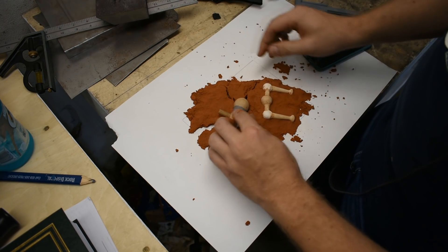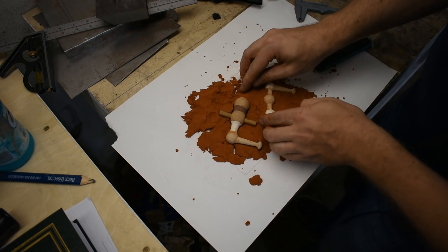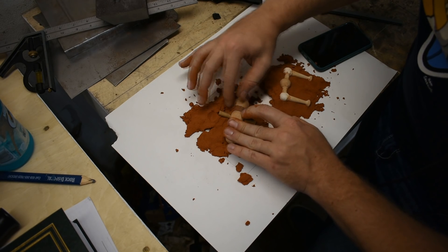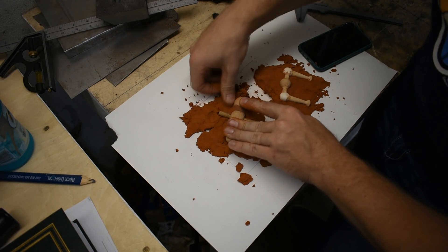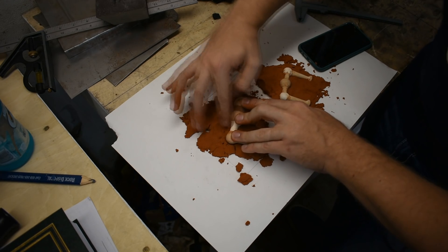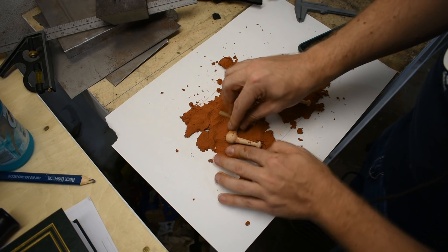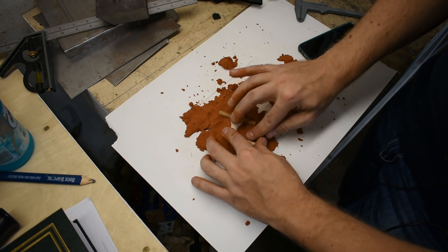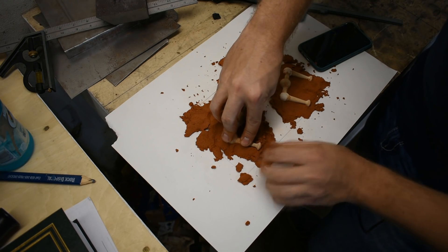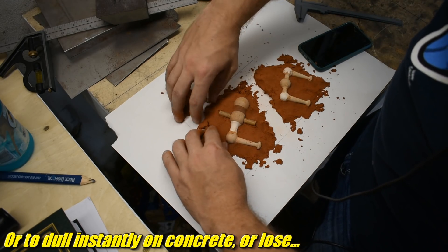I'm going to stick this one down in there. We're losing structural integrity of the sand — got an idea. We'll separate them. Now this piece of wood in the middle is because you're supposed to cast these with a slight hole through them. So I'm going to do one of them with the wood dowel technique, and the other one completely without a hole and then drill it in later. Because me and drills, we get along great — by which I mean it looks like I'm going to be buying some more drill bits to break. I think that's rammed up to the parting line.